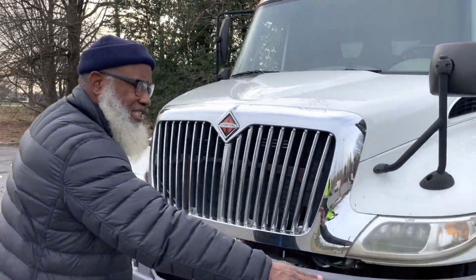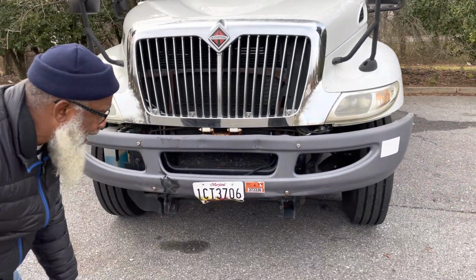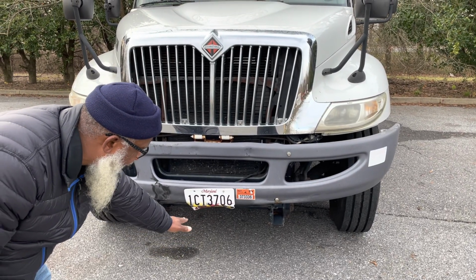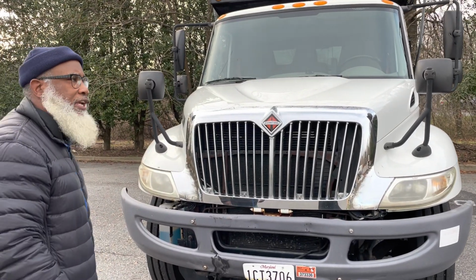The suspension is balanced. If it wasn't balanced, I will place my vehicle out of service. No leaks or puddles or broken glass or hanging wires underneath the vehicle. And if I had that, I would place my vehicle out of service. All tires are properly inflated to the manufacturer specification. This concludes my pre-trip for my Class B video.